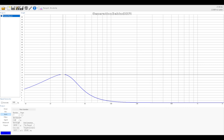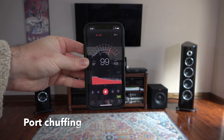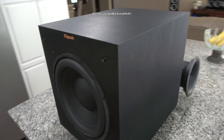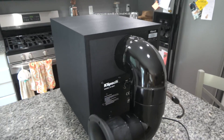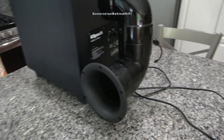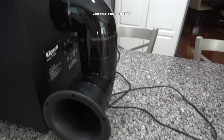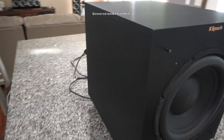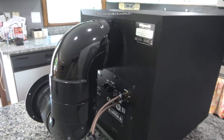Here is a quick recap of the port chuffing. If I had a second chance to redesign the port, I would definitely shoot for a port velocity number that is well under 20 meters per second. I haven't decided yet, but I might do a Franken-Klipsch version 2 video series where I redesign the port to eliminate the chuffing noises. If I can resolve those chuffing noises, then I think my Franken-Klipsch subwoofer could easily give my old PB-2000 a run for its money. The tonality and performance I got from my old PB-2000 reminds me a lot of my Franken-Klipsch subwoofer.